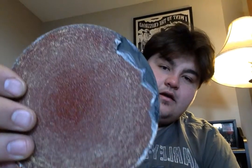One thing to keep in mind, you can see some cuts into the foam there. As your edge is getting thinner, it's easier to dig in. So what you want to make sure to do is have it rotate away from your cutting edge where you're pressing in. That meant for me setting it reverse to do this side and forward to do this side. So a trick, keep it in your pocket. Maybe you'll use it, maybe you won't.